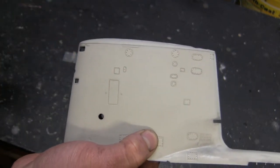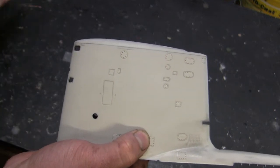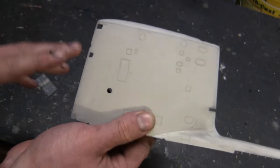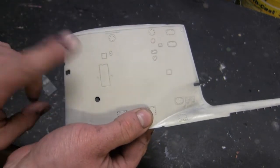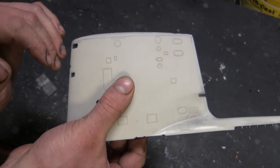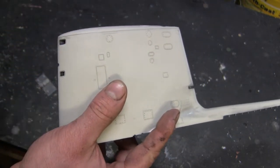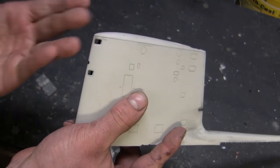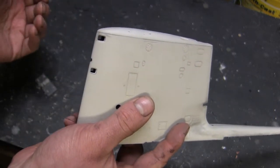All boats have a red and a green lantern found on either side of the vessel for port and starboard, and the submarine here is absolutely no different, but the submarine needs to be nice and sleek, so things like beacons add drag. So what they did on the Skipjacks was incorporate a system where the beacons are retracting, so when the submarine is underway underwater, they fold up and make for a nice smooth surface here on the side of the sail. But if you're on the surface or at port and you need to have the beacon's light, hit a little switch, they swivel out like a 1980s car, and you have the beacons ready to go.